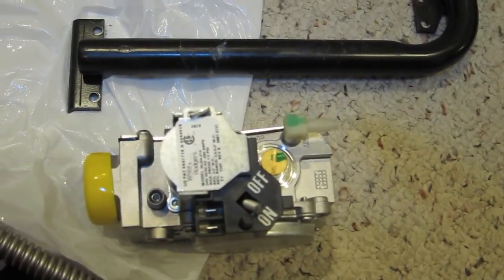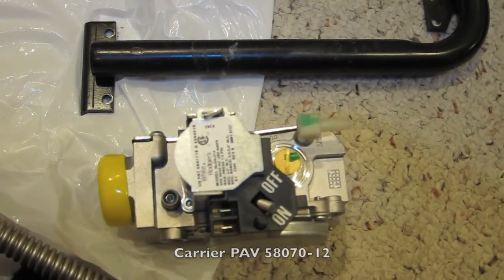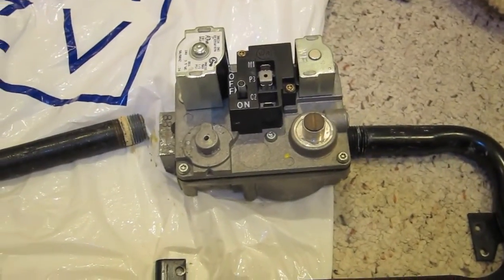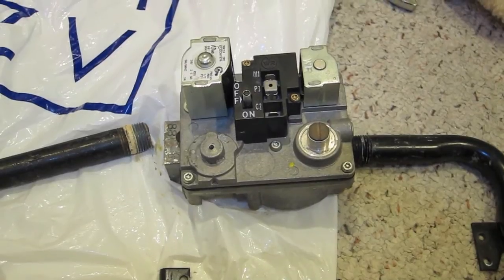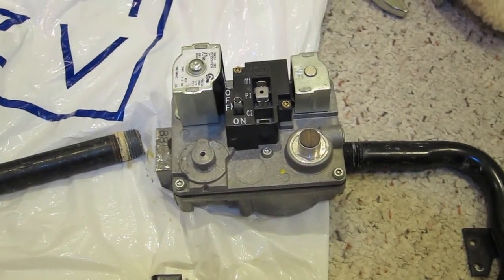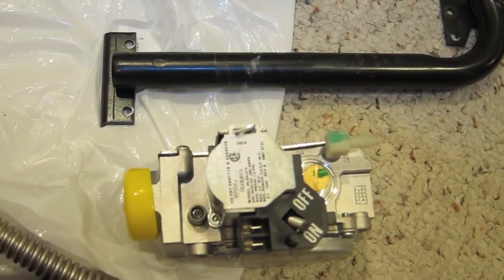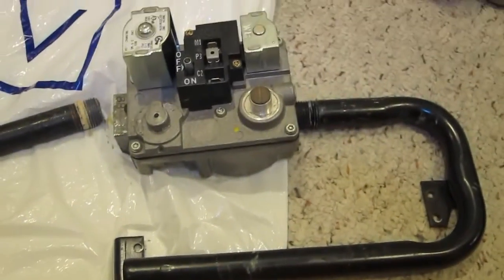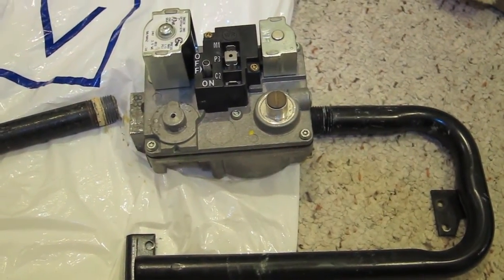I finally got a part — I bought a new part. My furnace brand is Carrier 58PAV, and this is the newest part; that other one is the oldest one. eBay sells a lot of old ones, but I don't see the point of buying that because you might have to go through this headache again. So I bought the latest replacement part, and hopefully this will work. I went through a whole series of tests on whether it's a circuit board issue, and it doesn't seem like it is.